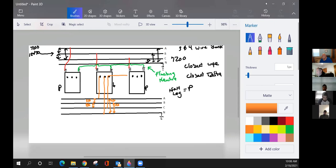And while he gets in the process of drawing those leads in there, the reason why we call it the lighting transformer in the middle, and that's the position it will always stay, is that the lighting transformer will be in the middle on a three-phase closed delta bank. It's the same thing it does for your normal house. If I were to take the two other transformers away, it would be a lighting transformer for a house. Hence why we give it the name of lighting.